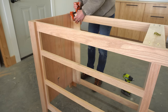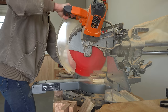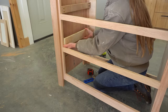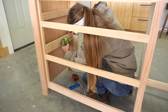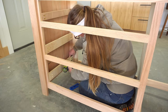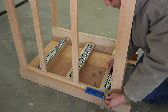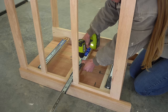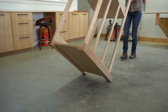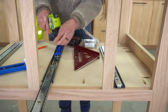That flush panel makes installing the drawer slides on that side much easier. For the other side I needed additional framing to mount the slides to, so I attached a scrap plywood strip across the back then added 3 pieces between it and the front face frame. Once installed, I added the drawer slides — 3 pairs of 16 inch slides set 1.5 inches inset from the front of the face frame, since I'll be making extra thick drawer fronts. I'll link a video on installing drawer slides below.